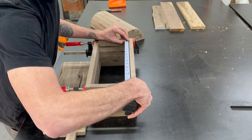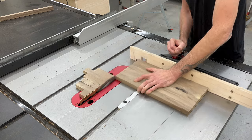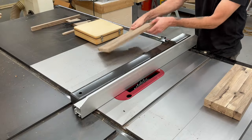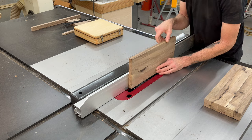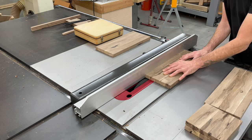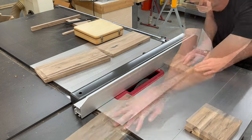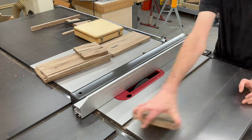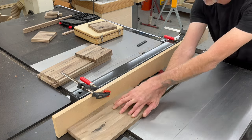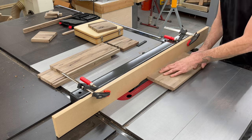We are going to add a half inch to each one of these measurements, then we can take the bottom panel over to the table saw and cut it out. Once the bottom panel is cut to size, I'm going to get a half-inch dado stack installed into the table saw, and then I'm going to cut a half-inch wide, quarter-inch deep dado into the inside of each one of the side panels. The quarter-inch deep dado is why we made that bottom panel a half inch longer and wider in each direction. Next we can put the sacrificial fence onto the table saw and cut the rabbets in that bottom panel, then test fit to make sure it works before cutting the remaining three sides.